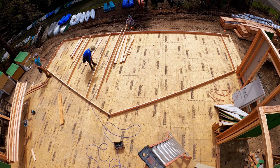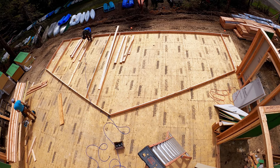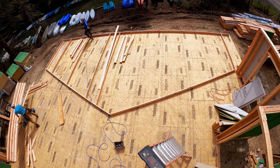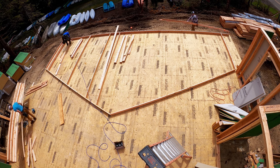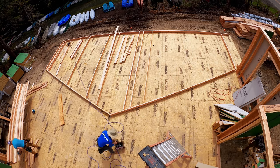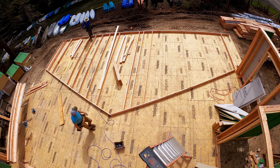While they're doing that, I went ahead and started cutting off of a different pile: trimmer heights, sills, cripple studs, and I think I even started to cut headers. And because the windows are kind of the slowest part, that's always where we start. They often get double king studs and we oppose the crowns, and that way as you oppose the crowns, you straighten out both boards, blah, blah, blah.